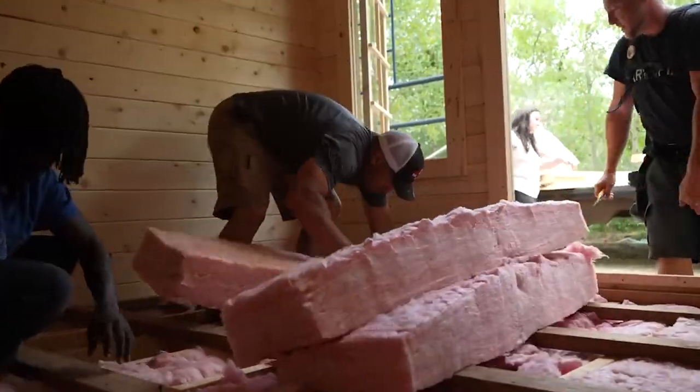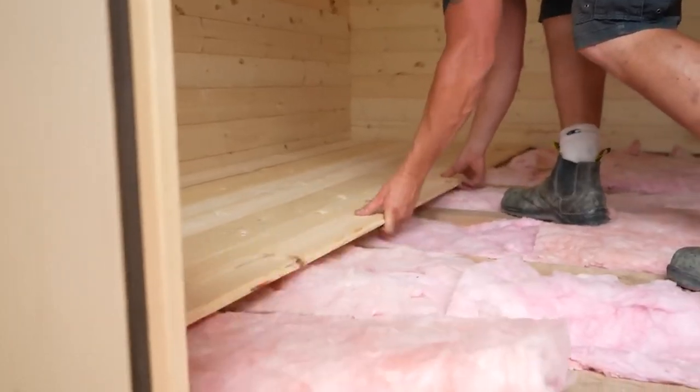That made it perfectly square with the sheeting. The house wrap protects from rain splashing up off the gravel from ever touching any of that OSB, and it's mouse-proof. I did throw in R20 insulation in there with no vapor barrier because of the nature of the rest of the building. I can literally come in with a forklift and move the cabin somewhere else — or maybe Nate buys property near me and wants this thing. Just move it.